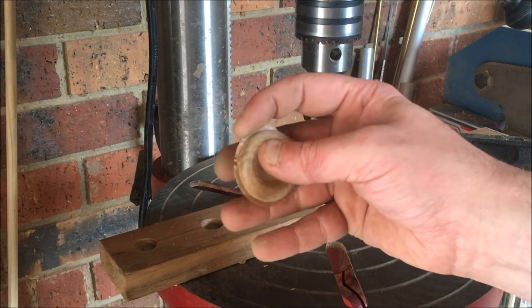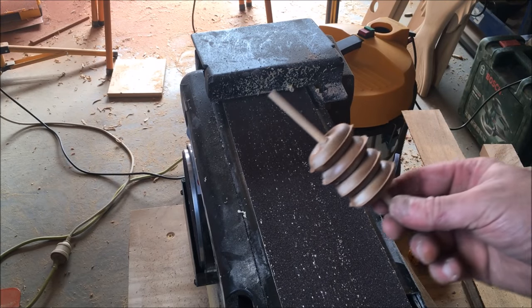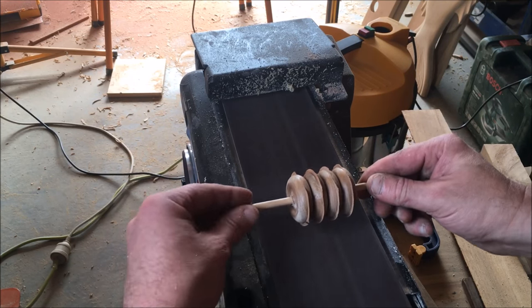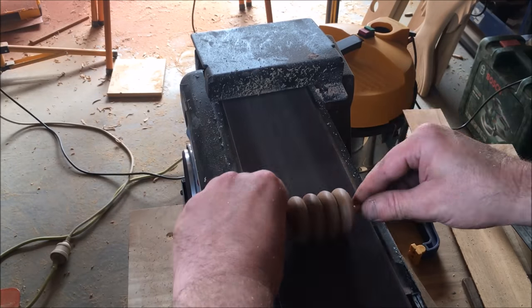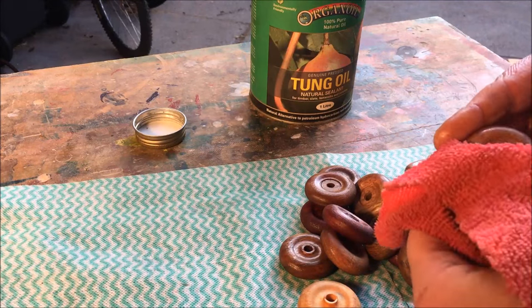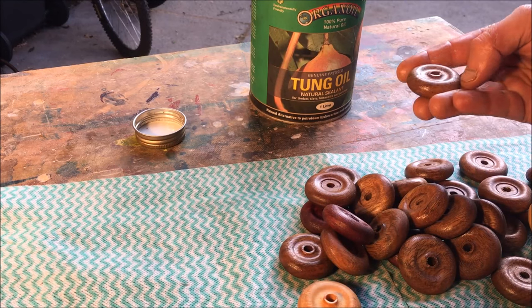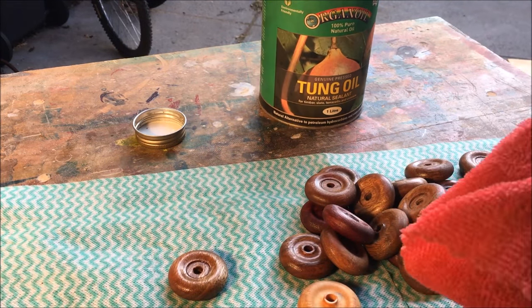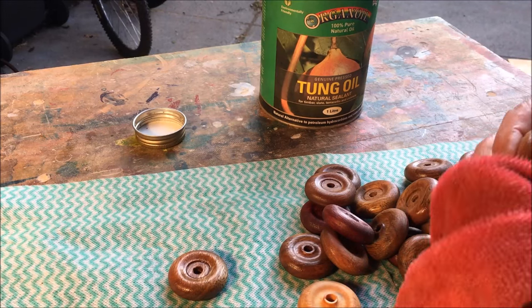There's a little edge which is easy to peel off. One of the easy ways to take the edges off all together as a group is to just load them up on a bit of dowel and use a belt sander. After any light sanding they might still need, I'll finish them off by giving them some oil. The oil helps the wood swell and fill up any little gaps or nicks, and it gives a nice finish. I use 100% tung oil to keep everything organic and natural — especially important for baby toys.